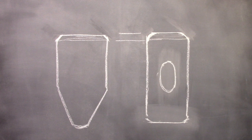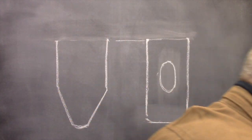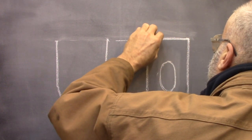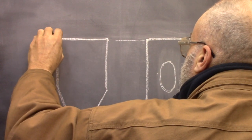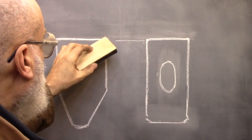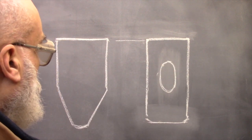These are hammers that are used at the anvil and they're used primarily to shape and forge hot metal. In my shop these are all cross-peen hammers so they're easy to identify. The other group of hammers that I have in my shop is what used to be referred to as machinist hammers — just hammers that are used for driving chisels and cold metal working and basic all-around work that isn't forging. The main difference between these hammers and my forging hammers is that the faces are ground perfectly flat and the edges just have a bare minimum of a radius.